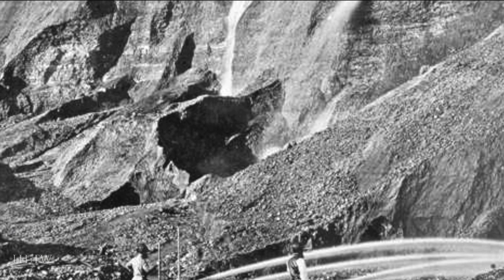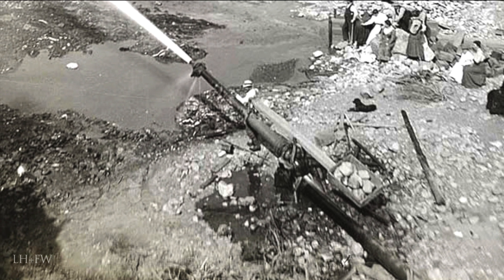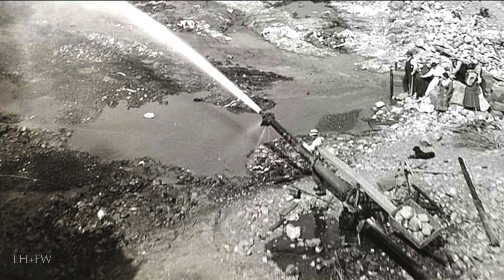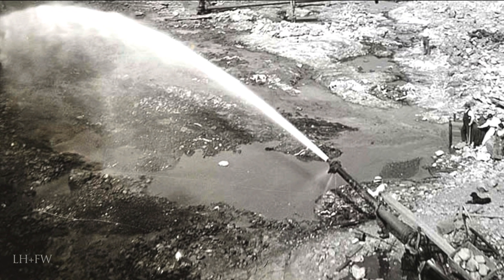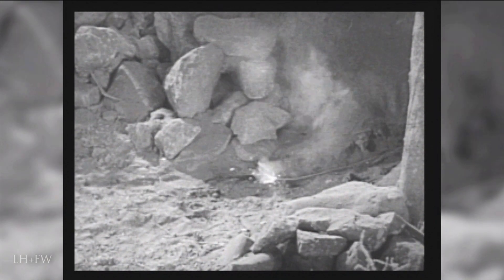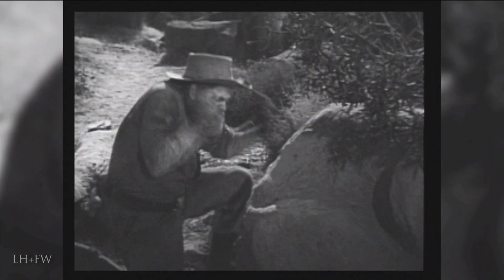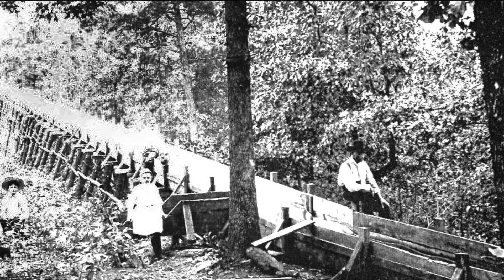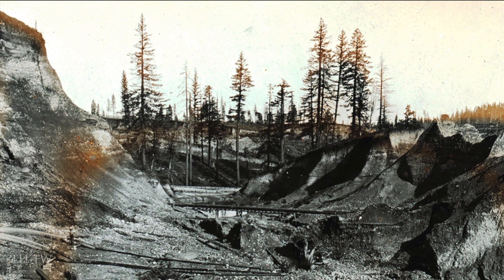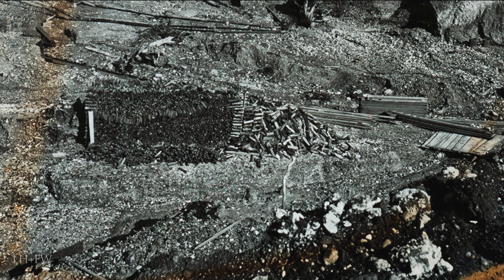With the advent of hydraulic mining, miners could blast away large expanses of sediment and rock. Water would be forced through a hose that grew narrower and narrower until it led to a nozzle called a monitor. At first, the hoses were made of canvas, but soon crinoline replaced it as the material of choice. In instances where miners found themselves up against a particularly stubborn piece of hard rock, they would create a hole, fill it with black powder, and touch it off to blast the rock, continuing to pummel the sediment with the hose. With the advancements in mining, the environment was being altered at an alarming rate, and the consequences of hydraulic mining would last for years.